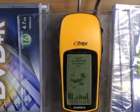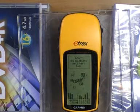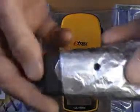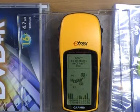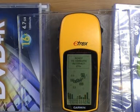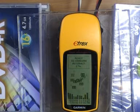A simple fix for the Mobius is to put some screening around it. I'm going to move the battery away, and on the Mobius I'll put a screen around it just made from aluminium foil. The camera is still recording and I'll place it underneath the GPS. When the battery pack is refitted the interference will have more screening from the camera to the GPS receiver. So for a Mobius, a very simple trick is to just use aluminium foil around the camera.